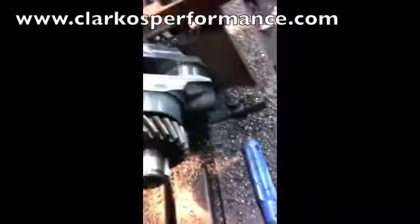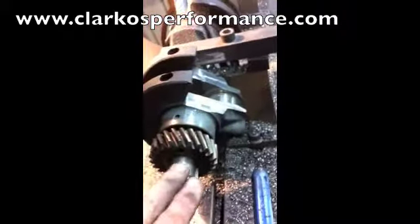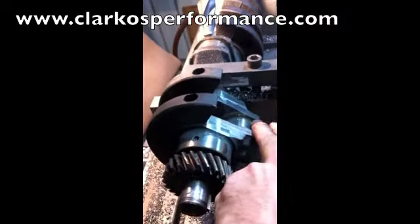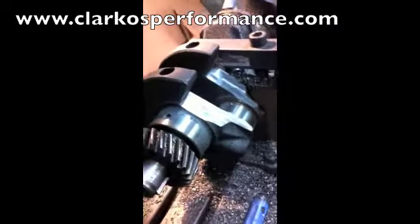Let's do a recap of what stage one was. Remember on stage one — as you can see there's a shitload of metal, so obviously there's a shitload of work going on. Virtually we lined up the top of this one, the tangent point of this to the tangent point of there, and just machined all the meat away. So that's basically a roughed-out version.